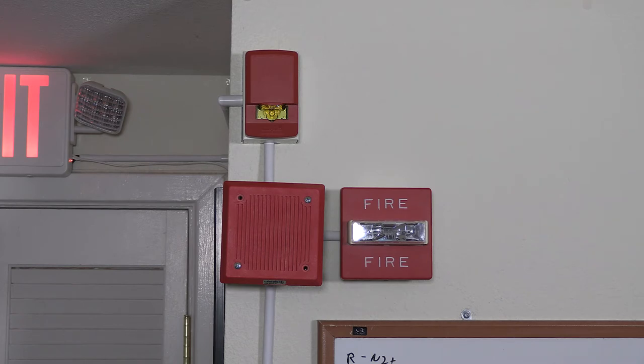The Wheelock AES-EL1 is a tri-tone, tri-input alarm. That means it has the ability to do three tones, and it has three separate controlling inputs for those tones. The horn has the ability to do a horn tone, a siren tone, and a warble tone, and each one of those selections has a specific set of contact points on the back of the alarm.